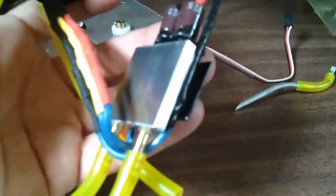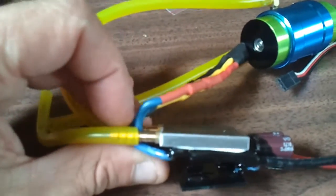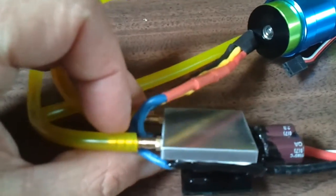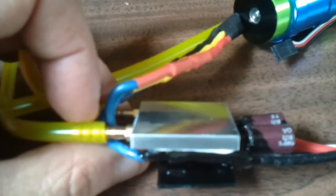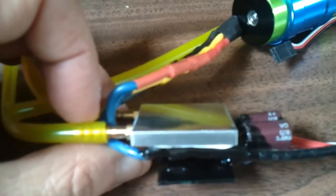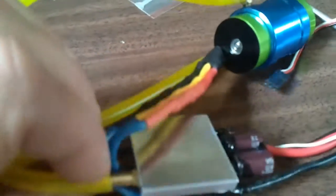The heat sink has been permanently attached to the top of the MOSFETs after they were sanded. I sanded the epoxy off the MOSFETs and sanded into the MOSFETs just a little bit. Then I sanded the aluminum water block and attached it with a two-part ceramic-based Arctic Silver Alumina heat sink adhesive. That's a permanent bond that will never come undone.